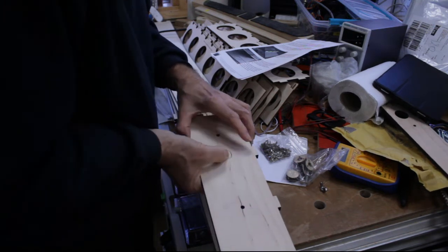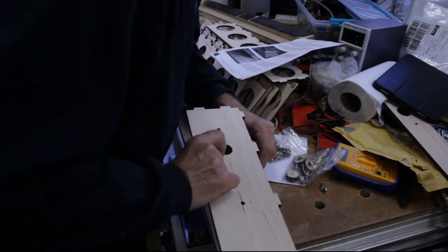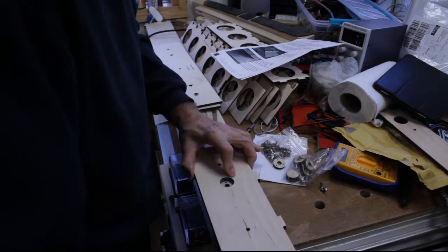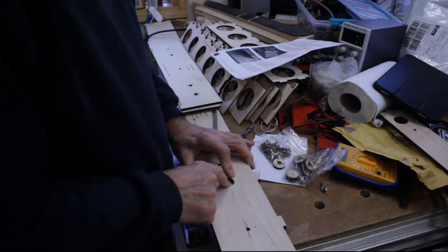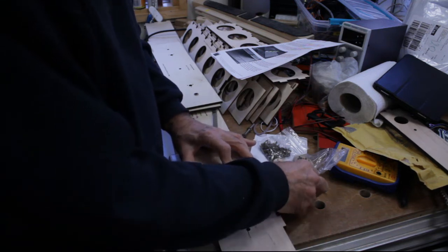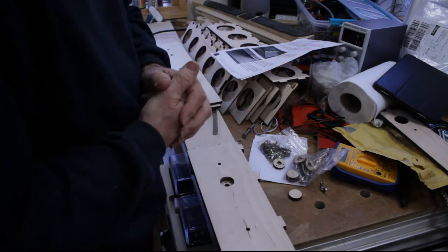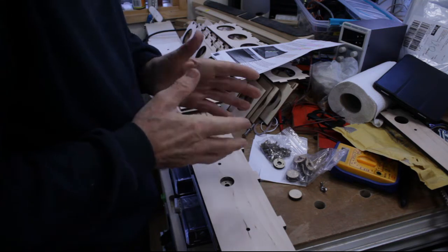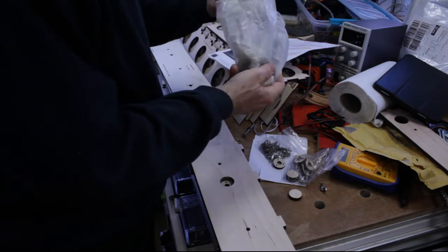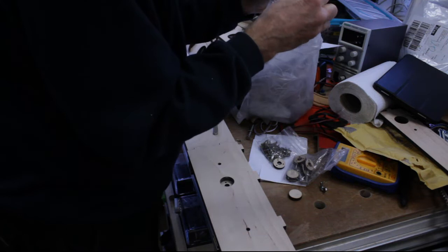They have done this for a reason. The accepted way of dealing with joints, and what most of the railway boys use, myself included, are pattern makers' dowels. These are things that are used in the foundry casting boxes that they use to cast steel and iron items, and they ensure that you get a perfect result every time. These are effectively something you've got to buy yourself. As it happens, I've got some up in the roof.